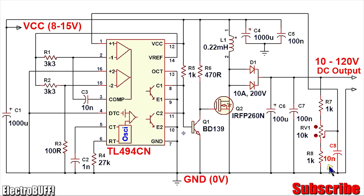The power rating for the boost converter is about 60 to 100 watts. With transistor IRFP260, which is rated for 49 amperes and 200 volts, you can obtain 100 watts without a problem. You can include additional modifications — for example, the secondary amplifier can be used for current sensing on either the output or the current through MOSFET Q2 to prevent overcurrent.